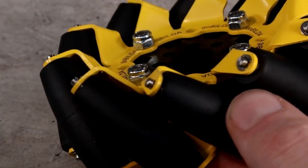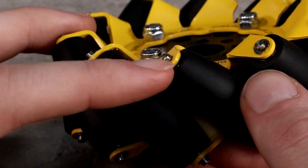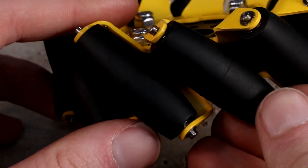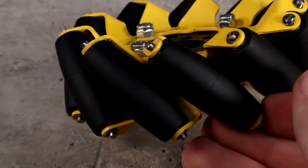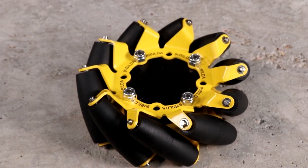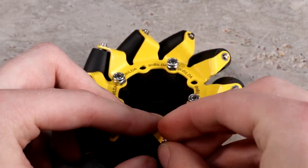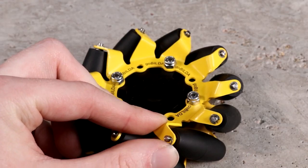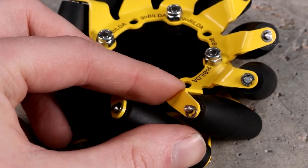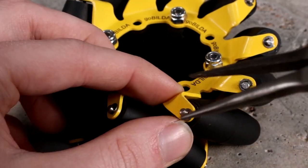You'll notice there is a neck on the shaft where the e-clip goes — make sure you can see it. I normally like to keep my finger here while reinstalling the e-clip. Grab your e-clip and set it beside the shaft to start engaging it with the ring. The grease from the bearing will hold it in place fairly well as it starts to latch in. Then grab your needle-nose pliers and pinch those two ends together to fully seat the e-clip.